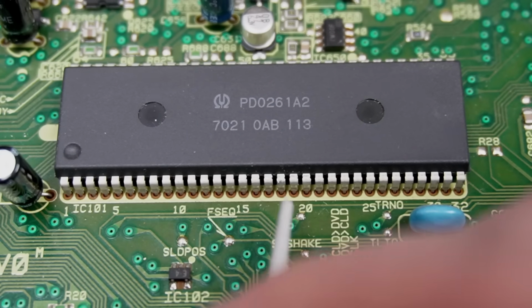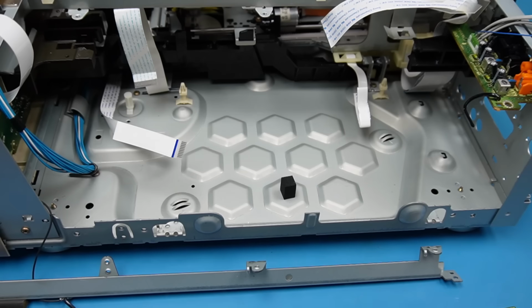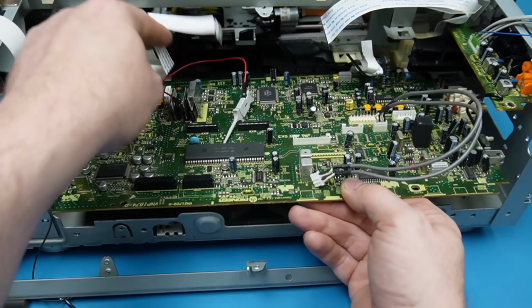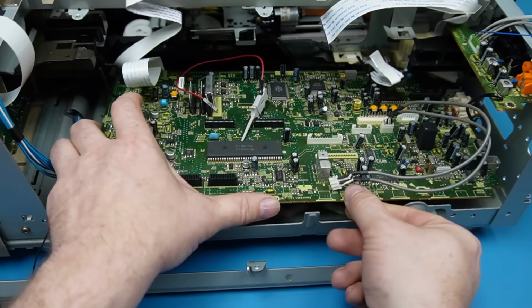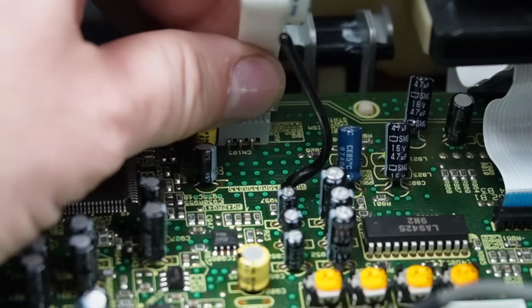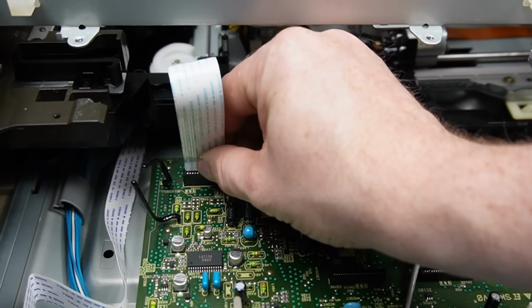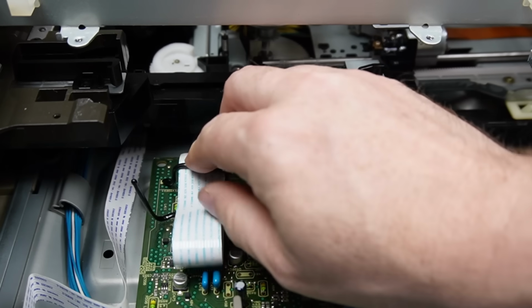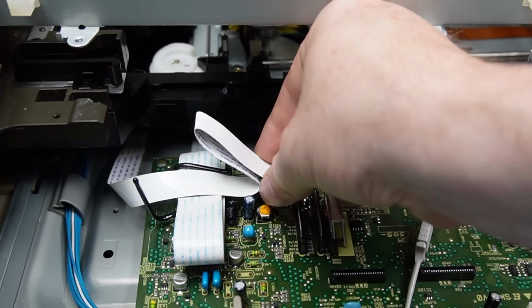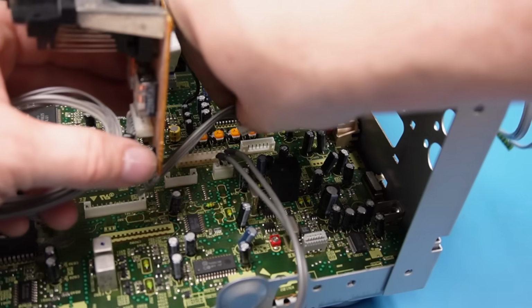There we go. Probing pin 18 is a little bit easier. Just use one of these fancy clips. Let's hope it lies down flat enough. Can now put this board back in. Keep the ribbon cables on the top. Let's get this ribbon cable in first. And this one, slightly hard to reach. And these two overlapping ones. And down like that. This one I think went over the top. Bit of a zigzag to it. Then the SCART socket module.